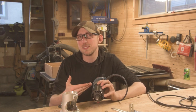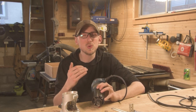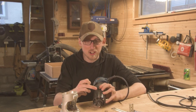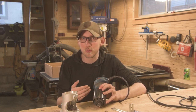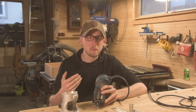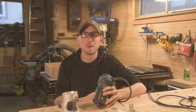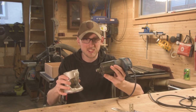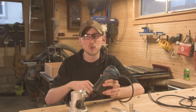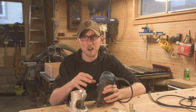The funniest part is that this is obviously an issue Bosch probably knows about but just doesn't care enough to fix. As soon as you Google this issue, or look it up on any woodworking forum where there are conversations about the Bosch Colt, everyone is talking about how the threads on their micro-adjust dial completely wore out on the motor with no way to fix or repair it. The most common solution people suggest is to just buy the plunge base — but the plunge base is not ideal for most compact router uses, because it takes a nice compact router and adds two handles and a bigger base, making it a bigger, chunkier router, which completely defeats the purpose.